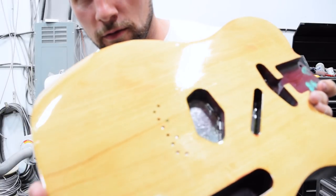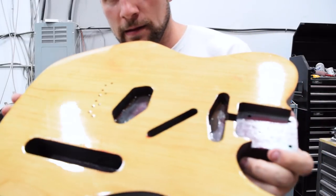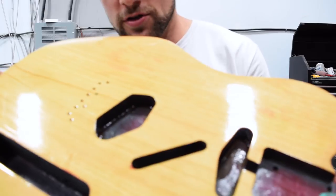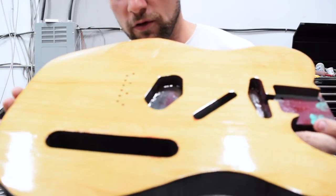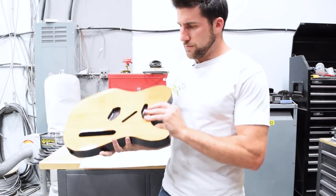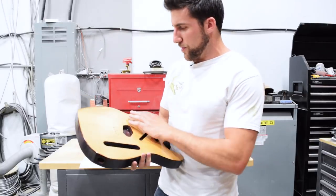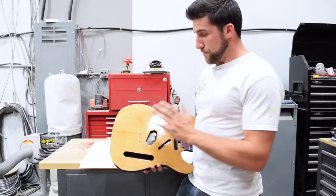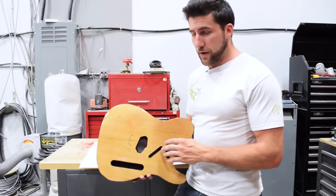So if you look, see how good an image we can get there. That's after your two coats, brushed on gloss. It's got some imperfections in it, but it is real shiny. So if you are happy with that, if you're happy after that with a couple imperfections in there, maybe a little bit of dust depending on what environment you're in, it's quite dusty in here, then so be it. You can leave it like that, and that is how you brush on a high gloss finish.